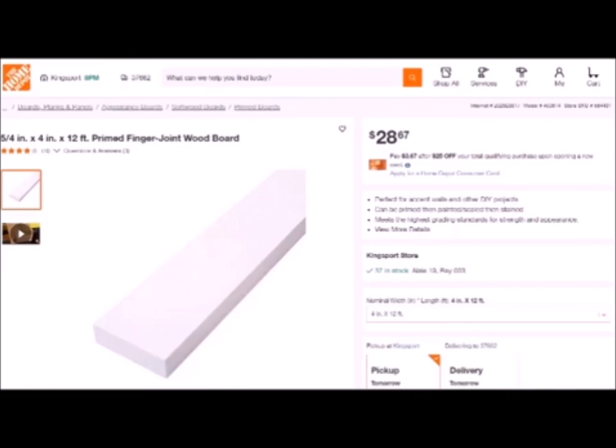We chose this trim board for several reasons. They are manufactured based on a finger joint system, free of defects, of excellent aesthetic quality, with tremendous mechanical and physical resistance. They do not warp like traditional wood products. They have very smooth, ready-to-paint surfaces. These pieces are pre-finished with 2 layers of exterior latex primer.